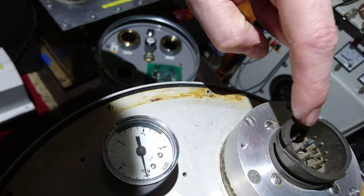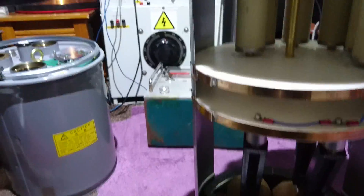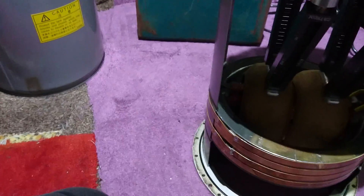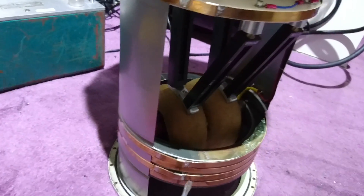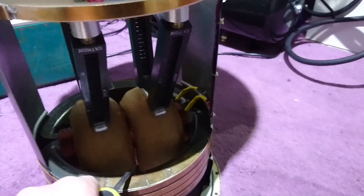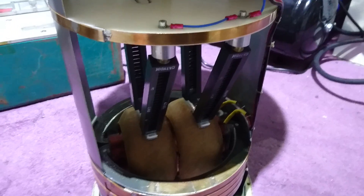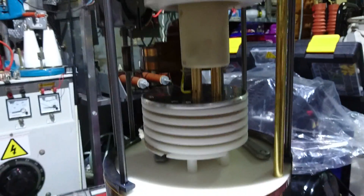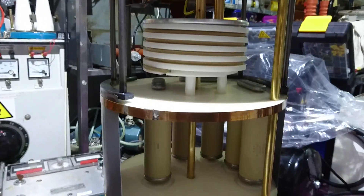The diodes connect onto the secondary of the x-ray transformer. The primary wires for the core come out of the transformer going all the way up through this tube to the top, which go to these pins just here. It's extremely well made — copper bands around the transformer hold the iron core together, two here to hold it against the outer shell, and another two to hold the iron core together. This is a 50/60Hz transformer running at around 220 to 240 volts, giving you 120kV DC output from the federal connector.